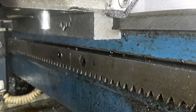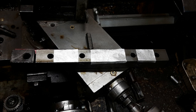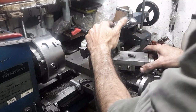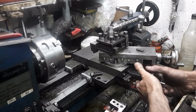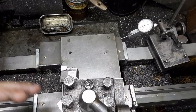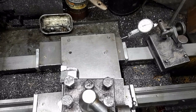The top of the gib was installed. I had to shim the gib so that the carriage could slide freely, and there is very little lift. Whilst I was at it, I decided to check the other gib. The DTI moved 0.02mm when I lifted the carriage and 0.05mm when I pulled down on it — so a total of 0.07mm.